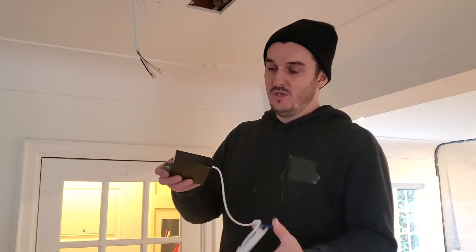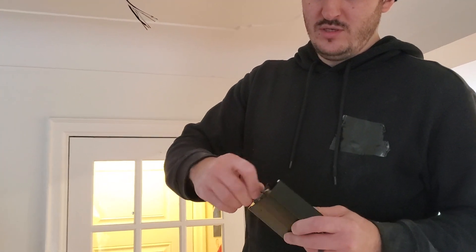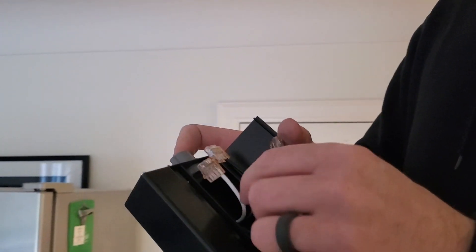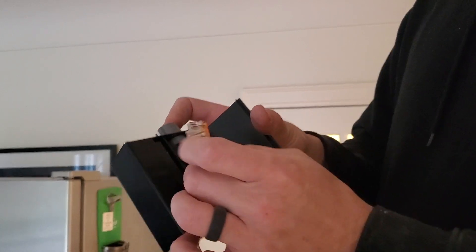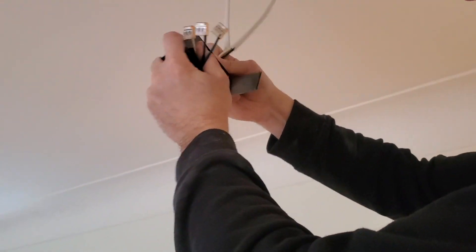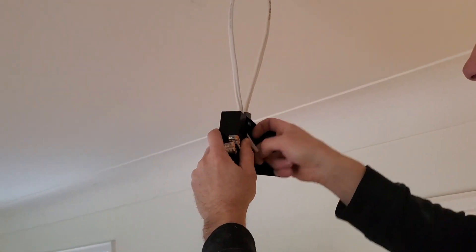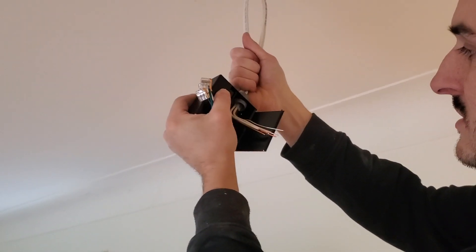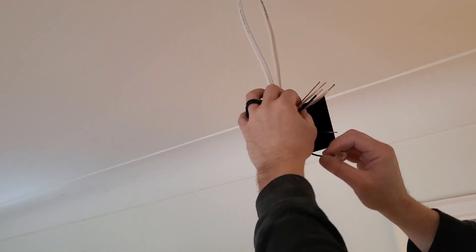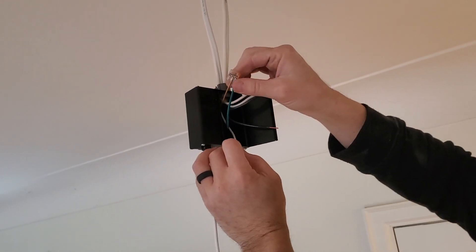Here's a pot light that we're using. You do have to get gray connectors to put into it, and then inside you've got a green for your bond, a black and a white. You just take your wires, put them through the gray connector, and make sure that the outside white insulation is tight in there. Then you're going to start with your bare copper — it's going to go into these little quick connects.